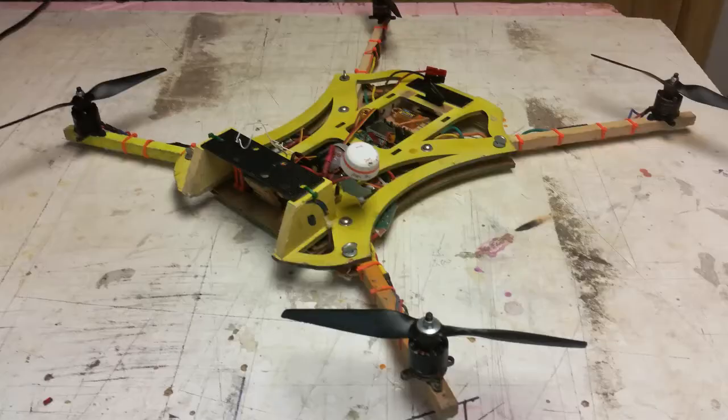If you're shooting photography, those vibrations will make their way into your camera settings, depending on how much vibration dampening you have. But these have virtually no vibrations. For racing, that's a different story. We put both of these on a test sled — our FPV Tree Racer homemade frames — and we put a Pixhawk on it where we can do in-flight monitoring. We found that with proper vibration insulation on a flight controller, using half-inch weatherstripping, there was no vibration difference at all from this motor to this motor.